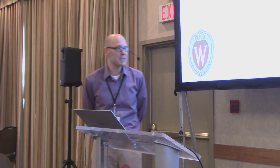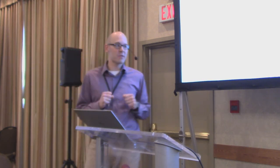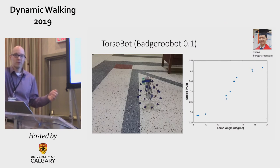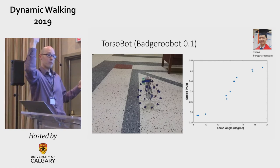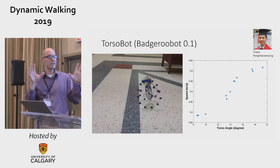Question from Alex: where is your center of mass in the Badger robot? It's somewhere above the hip — probably about halfway up and probably in front of the hip. How do you stabilize it? The stability and mobility properties are inspired by self-balancing Segway-style robots, but they're actually completely different. All you have to do is hold it still — having two points means it's stable over a significant range of torso angle. Unlike a self-balancing robot with wheels, a steady-state speed requires a positive torso lean to keep putting work in, because there's a continual loss step over step. Something with wheels will accelerate with a trunk lean and then stand back upright — so the stability properties are completely different and super easy to actually do.